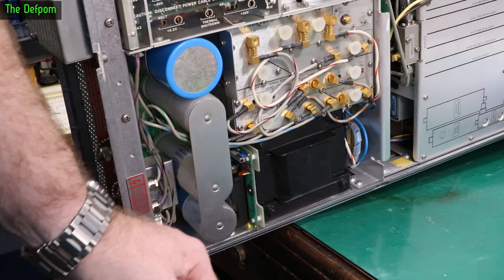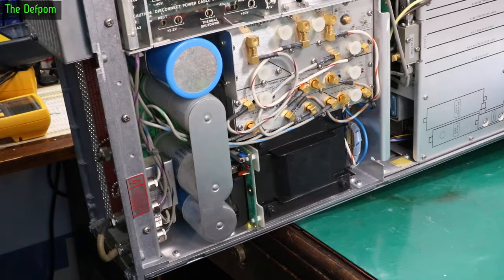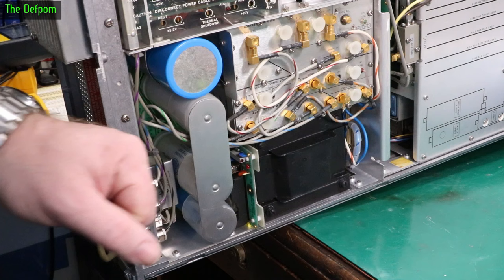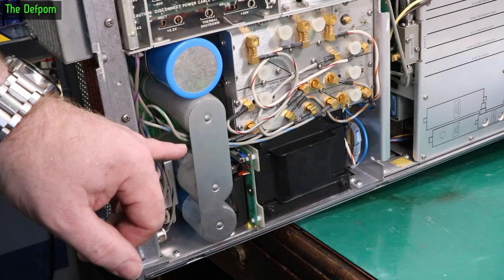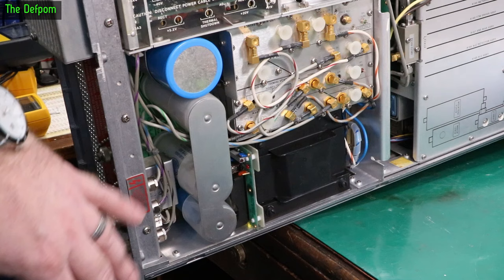I put in a used capacitor. These caps tested kind of okay but there was a bit of ripple on the supply line, which has been bugging me. One of them has already leaked — any one of these could leak at any moment. It's worth replacing them. I want this thing to be in a state where I can power it up and it will probably work. More importantly, a main power supply cap blowing could shove AC through the rest of the circuitry and blow up tantalums — tantalums do not like AC ripple. I'm replacing these to make sure the power supply is as good as it can be and doesn't cause any cascade failures.